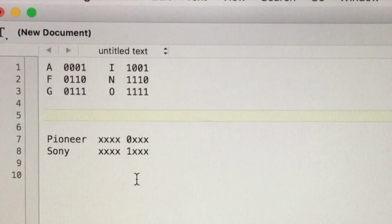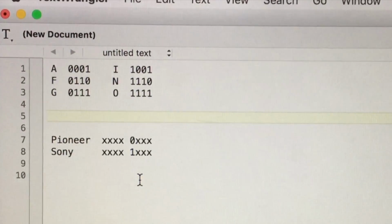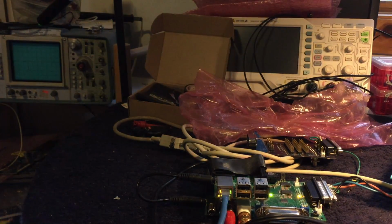And what that would mean is there's likely some sort of an I/O chip on the board that has a bad bit. Unfortunately, there's no schematics for this board, but it's relatively simple. Hopefully we can sort out what's going on.